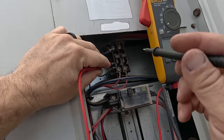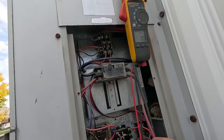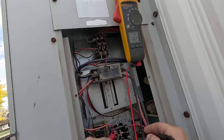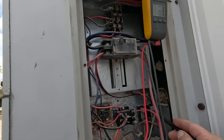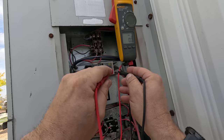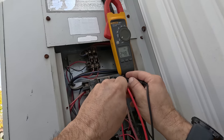That contactor looks partially burnt. I don't have 24 volts on that. This is your fan relay, I believe. Got 23 volts on that and it is closed. Power coming in, some light gauge looking wire. Here's our power wires coming in - we've got 248 volts there.